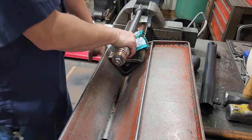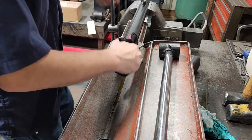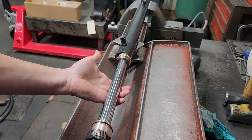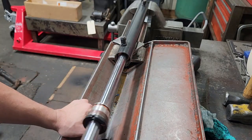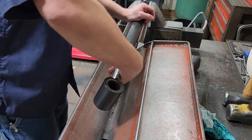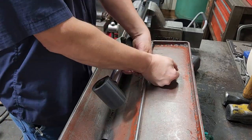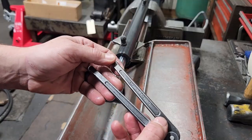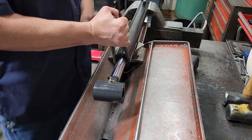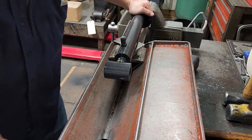Pull that back down again, remove the rod, set it to the side, grab the tube and put it back up here. What I like to do is pull the gland back a little, then take the piston, insert it in the tube while pushing and holding pressure, walking it in up to the gland. Turn it in as far as we can by hand, then take the spanner and continue tightening until we're all the way in. This set was a Williams 482, which actually has fuller pins than my other set. Finish tightening, make sure it's all the way tight, push it back in, and the cylinder's done.